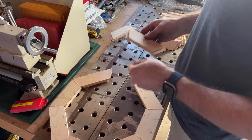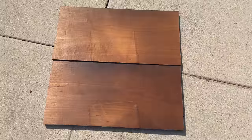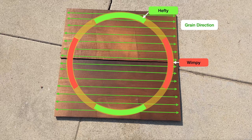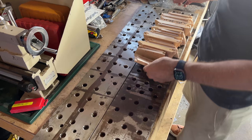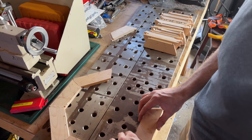To make our two donuts, we're going to start with octagons. We could just glue together two pieces of wood and cut out the rings, but that would leave us with a very weak steering wheel. Wood is much stronger when it's loaded along the grain — the fibers all run in one direction, and if you try to bend it perpendicular to the fibers, it will break. This is bad for a steering wheel — it could break, and then you'd be picking splinters out of your hand while your car careens off a cliff. To eliminate this possibility, we're going to cut out strips and arrange them into an octagon. Eight trapezoids make an octagon without a center — it's kind of a low-resolution donut. If I was making a steering wheel for a Cybertruck, I'd probably just stop here.